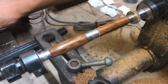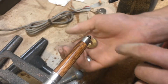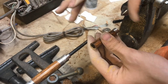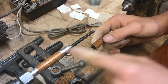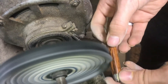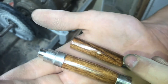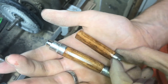That's amazing — that's just about all I need to do. But I'm going to take it over to the buffing wheel and that makes it look like glass. Whenever I take these off I want to keep their position memorized, because I don't want to line up these edges wrong — I have the grain lined up. Especially with pens with more prominent grain, I try to keep those lined up so when the pen is closed the grain still flows. Here's the difference between one that's been buffed and one that hasn't — this one has more of a satin finish and this one is much more of a high gloss. Personally I prefer that high gloss more; it makes the wood look wet and I really like that.